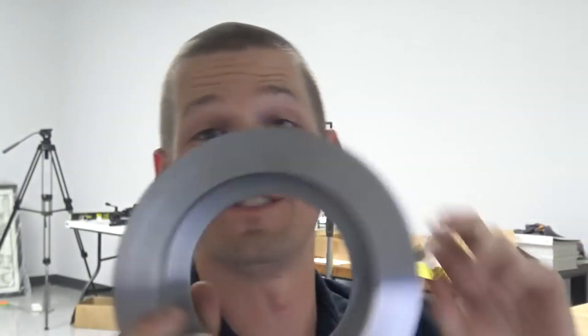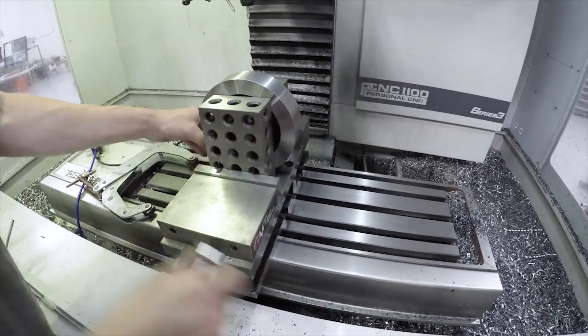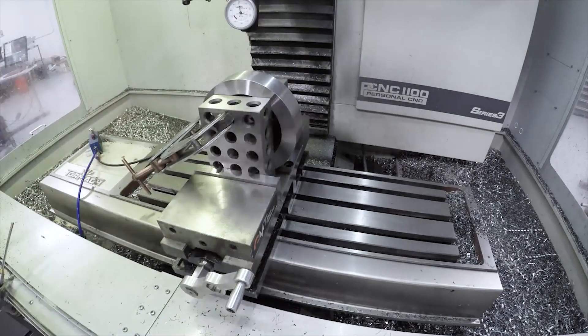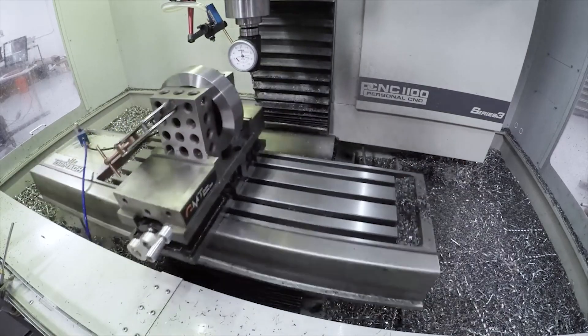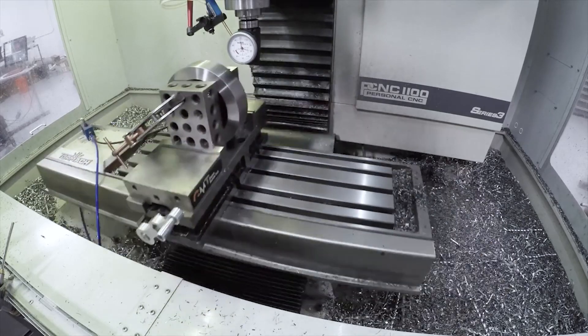Next up, we had a relatively tall ring that needed a drilled and thread-milled hole. It had square faces so a vise would hold it, but it wasn't tall enough or secure enough. Simple solution: sandwich the part between a pair of 246 blocks, which alone massively increases the clamping power of the vise. You can further improve it by adding a clamp across the 246 blocks as you sandwich the part.